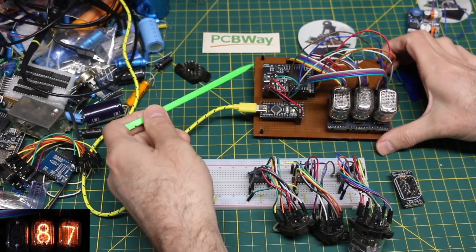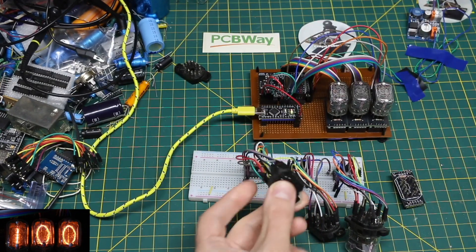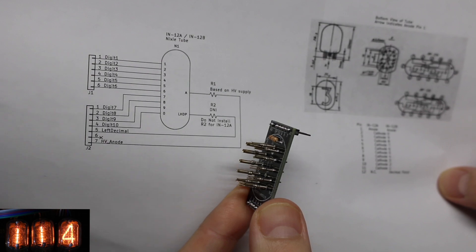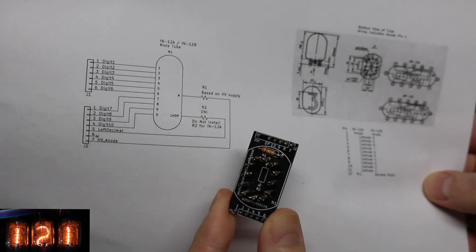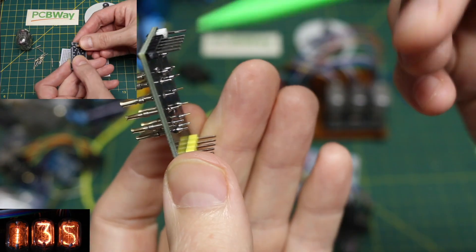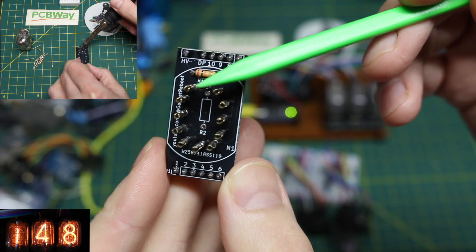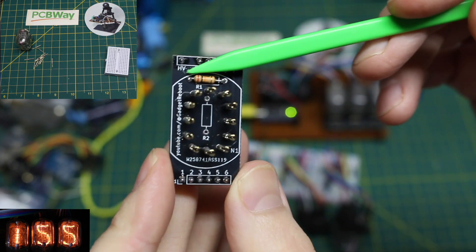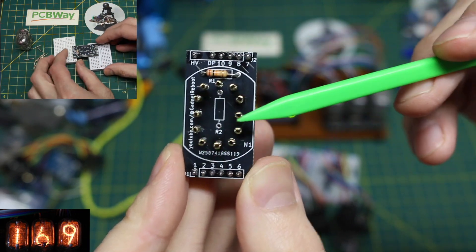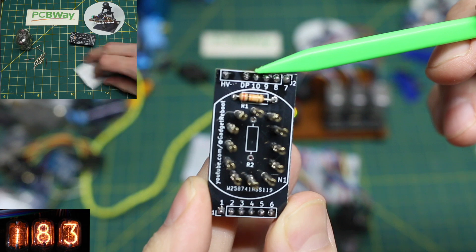Right now that driver is right here on sockets on this protoboard. I needed a better way to hook up the actual Nixie tubes, so I made this Nixie tube socket breakout header board with today's sponsor, PCBWay. The idea was I could have header pins that I can plug into either a breadboard or a PCB, to provide the anode high voltage supply to the tube through a current limit resistor, and have access to the pins for digits 0 through 9 and, if the tube supports it, the optional left-hand decimal point — but my tubes don't have that.